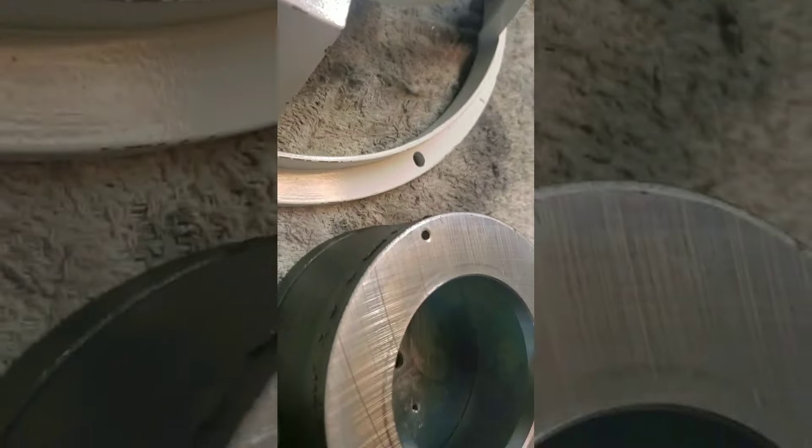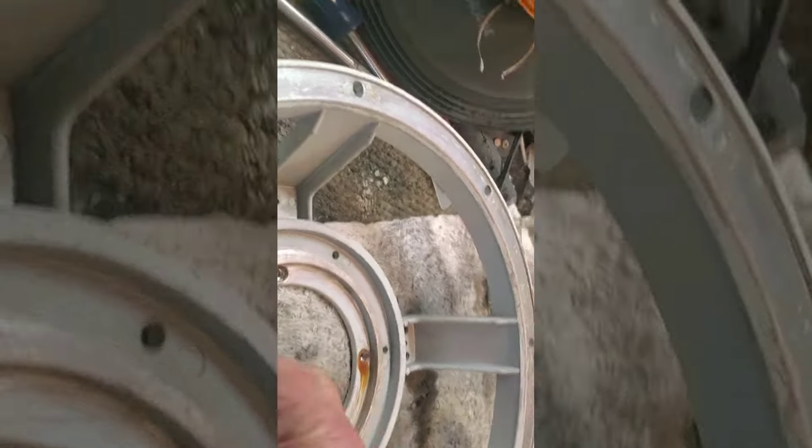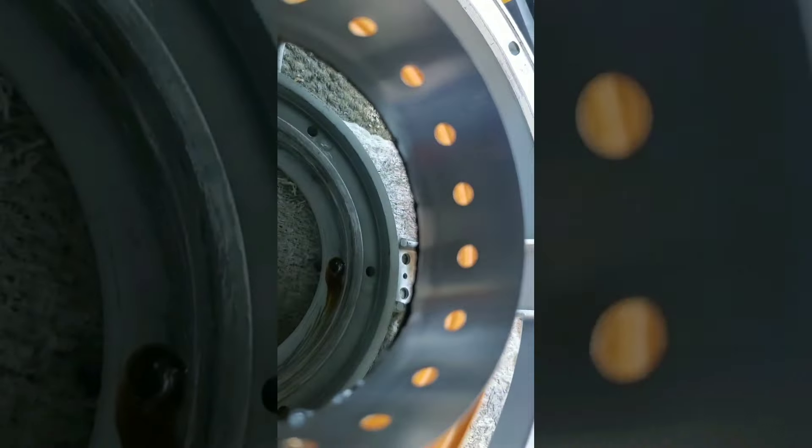This is an Altec 417 that was reconed in 1990 with an Altec 917 recon kit, because Altec discontinued the 417 cones and the factory recon kit for the 417 was the 917. The problem is the 917 is a much heavier cone — about 30 percent heavier — with the same voice coil winding. This one is on an aluminum former.